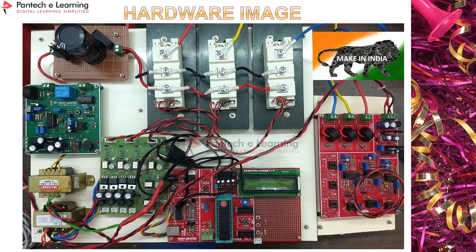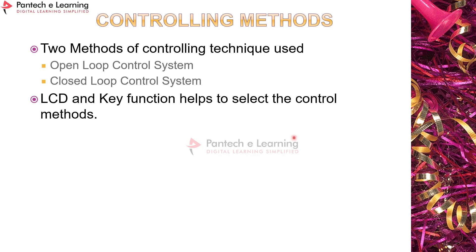This is the full hardware image of the prototype. It includes the DSP 30F4011 controller with programmer, TLP 250 driver board, protection circuit, current sensor for overload trip via relay, rectifier and filter circuit, DC fuse, and three-phase inverter circuit formed by a Semikron device. The inverter output connects to the signal conditioning board and then to the three-phase induction motor load. Auxiliary power from a 15-0-15 transformer powers the TLP 250 driver, DSP controller, protection circuit, and current sensing board.